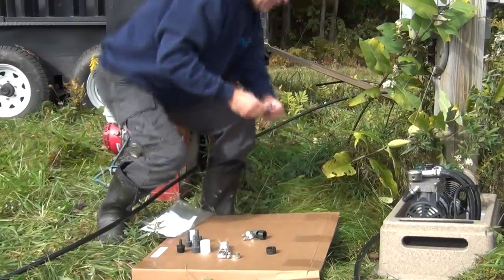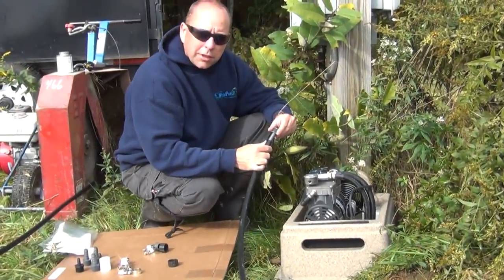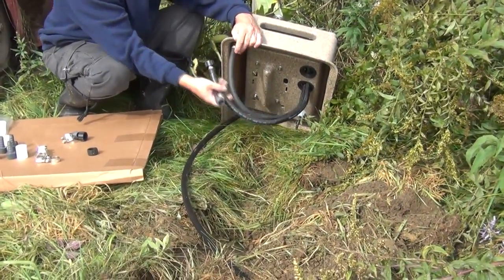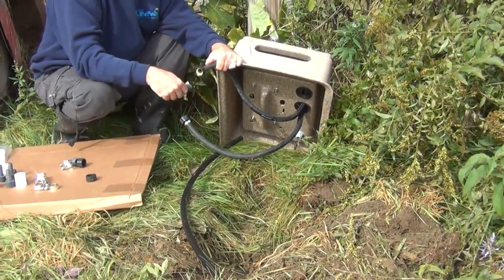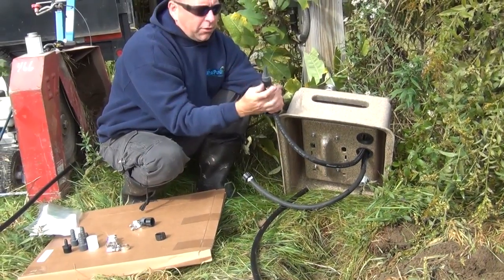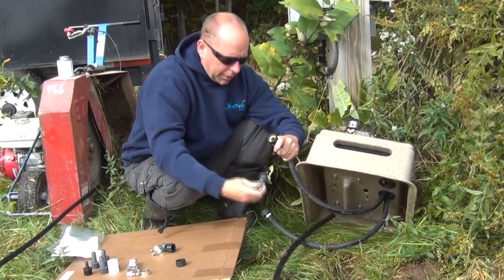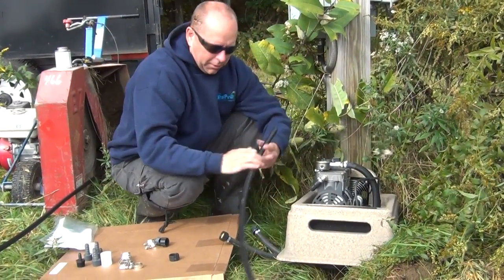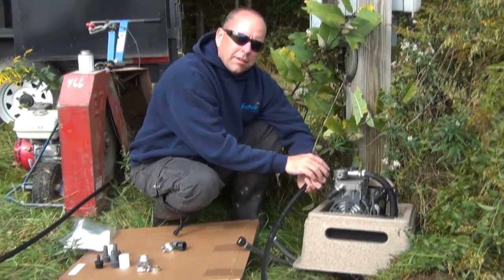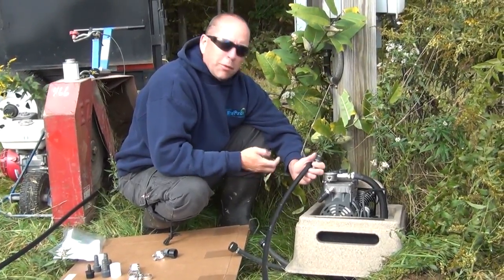Here's our direct bury tubing. It will go in here, we'll get a hose clamp on it, it comes up underneath the unit, and it's kind of like a garden hose — it just screws on. Screw the 5/8" to 5/8" and we're all hooked up. Now when we're done for the winter and don't want to take it in, we can unscrew that, put the end cap on, and leave this laying on the ground. There you have it. We'll finish buttoning it up and get it fired up here shortly.